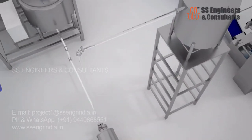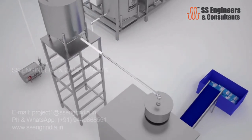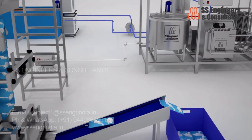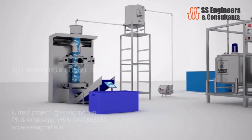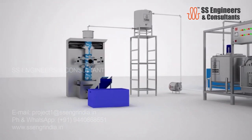The pasteurized milk is then transferred to the milk storage tank for further packaging. The pasteurized milk can be packaged in food-grade plastic pouches in different volumes as per the consumer demand, and thus can be stored in cold storeroom at +4 degrees till they are being consumed or sold in the market.